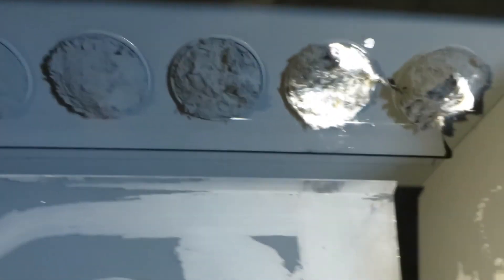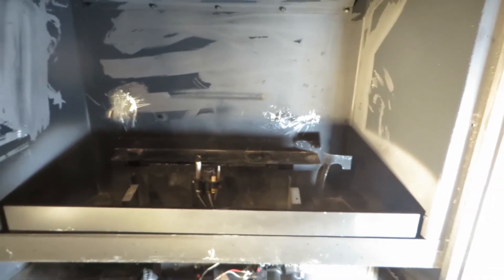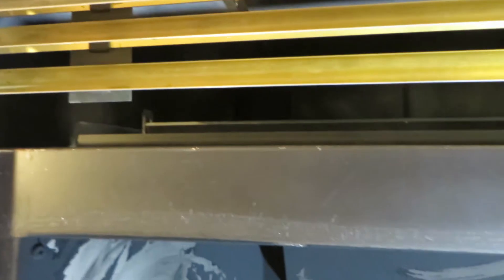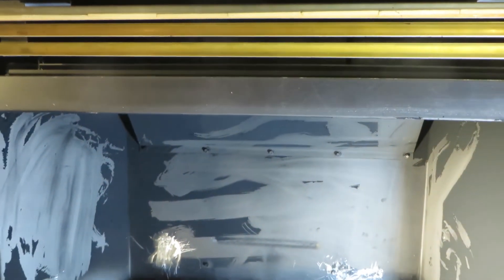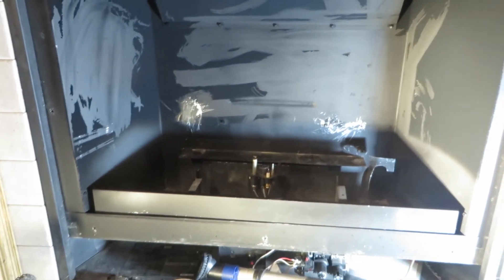One of the other things I wanted to show you is the top of the fireplace — you can see the baffles. There's a bunch of holes up there. This is a direct-vent gas fireplace with a glass door on the front. If you have delayed ignition and it goes boom, there's a spring-loaded trap door up in the top that will lift up and release the gases, instead of the glass door blowing off into the house.